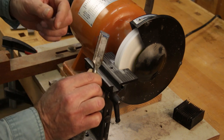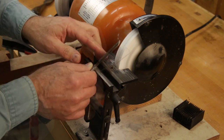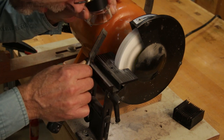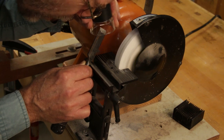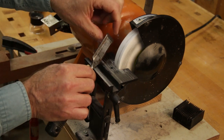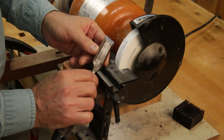It's really important — don't lose your grip as you continue to grind. I've got what appears to be a pretty nice bevel here. I'm going to scrutinize it with my loupe. I can see that yes, I've got a very nice edge — just a hair's width. It's beautiful. The bevel itself is nice and even across the face. This chisel is ready now for the honing stones.